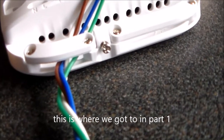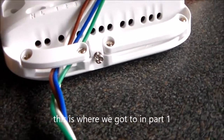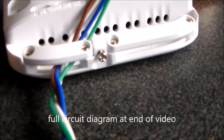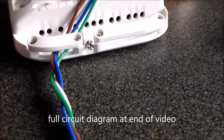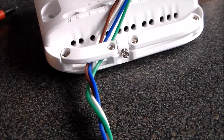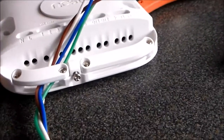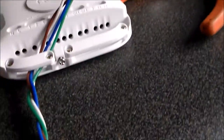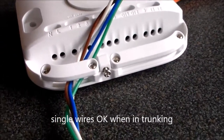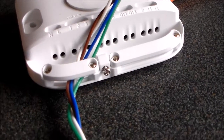I'm using unsleeved wires because I wanted four wires and the cord grip doesn't screw up tight enough to trap single wires. My intention is for this to be all wired within the confines of the boiler housing, not thrown out, so it's not like an exposed flex. For testing purposes only I'll be using this, but for future installation it will either have to be three-core wire or a multi-core four-core wire with overall insulation.